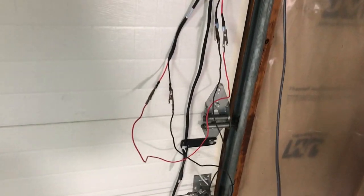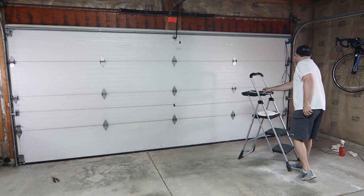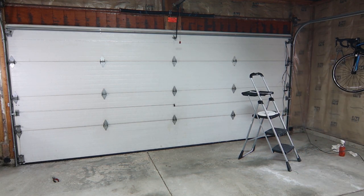I have the plug plugged in and some jumper cables here for testing — black routed to black, red routed to red. This is DC power so I'm making sure they're not touching anything. I'll run this back to the power supply and plug it in. Boom — look at that! First LED strip up and running. Always good to test your work before moving on to the next step. I'm going to repeat this step three more times, starting from the top of the garage door going to the bottom, to get the rest installed.